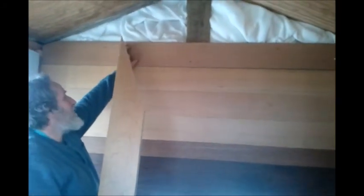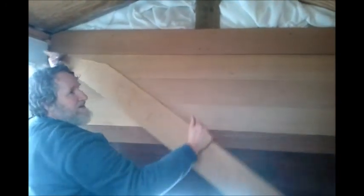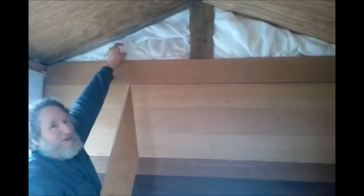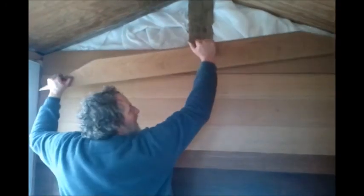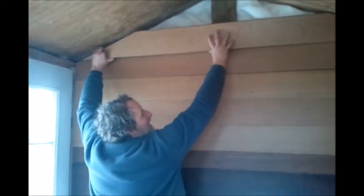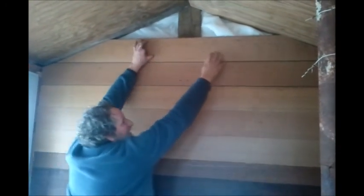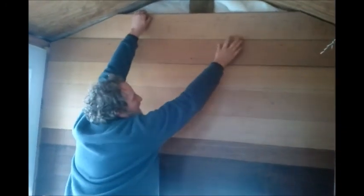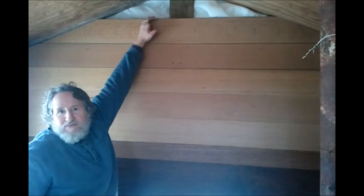We're just finishing up putting the flooring on the walls in here. Once you get into the peak part, all the boards have to be cut. I'm trying to do this pretty easy — the only thing I'm going to nail to is actually in the middle. The ends are just going to be held in with the tongues, and you can see we stuffed the ends with insulation from our batting. This piece is cut on an angle on each side — we'll get it in there, get those pieces down on the tongue, and then nail it in. We've got maybe one or two more pieces to put in on the end and that'll wrap the inside up.